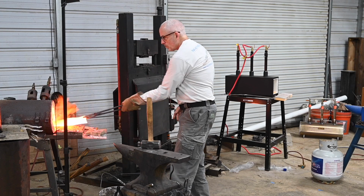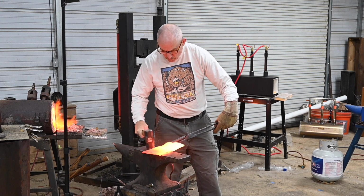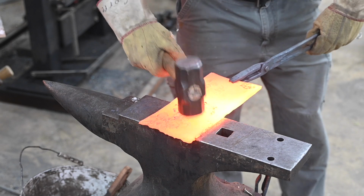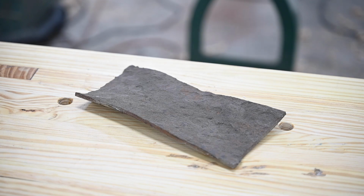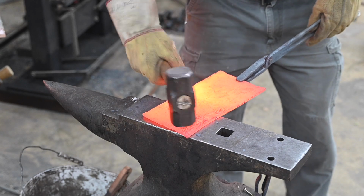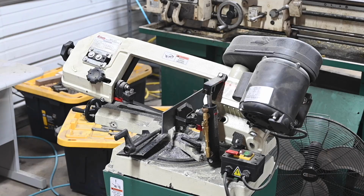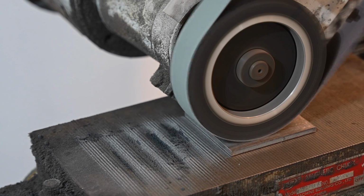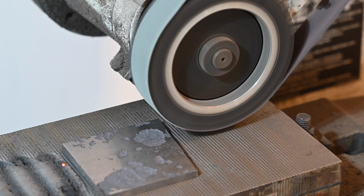For those of you who don't know much about it, wrought iron was made by a very labor and skill-intensive process known as puddling that predates all the giant ladles full of molten steel that we associate with modern steel making. In this case, it has a really deeply pitted side, the interior of the water tower, I guess, which we're going to use as a design element. First, though, I'll smooth and flatten the piece. I'm using a surface grinder, but I could just as easily have done it on a belt grinder. As you can see, we're keeping these defects on the back side.